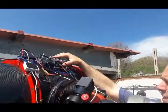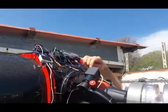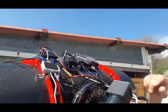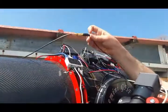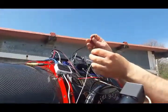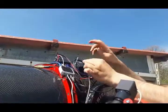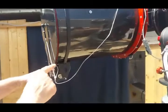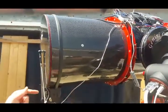I have fixed the control box on the telescope tube, and now I'll show you the connections. This is the output from the controller, and I have to connect one cable to the power supply of the flat panel, and the other cable to the motor. Finally, I connect the flat panel cable to the output of the flat panel power supply. It is important that the cables coming from the motor and the flat panel are fixed and routed in a way that they never interfere with the cap opening and closing.